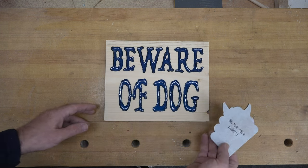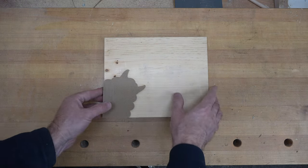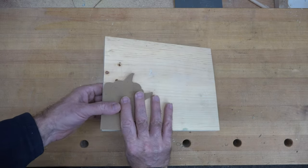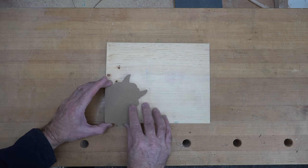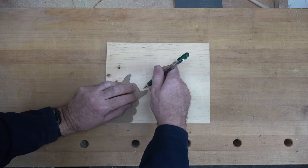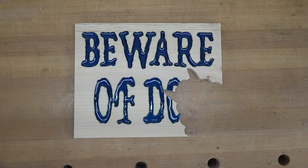With the marking template done, we're going to place it on the back in what will be the bottom right corner of our sign — so it'll be on the bottom left when you flip it over. We line up the template with the corner and trace it out. Then we take it over to the scroll saw and cut this out, and after a little sanding around the cut area, you end up with this. Isn't that awesome? It's like your dog is taking a bite out of it!